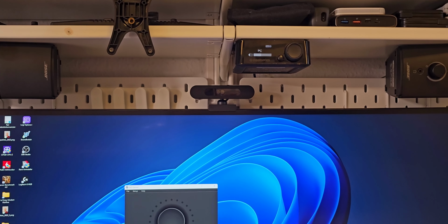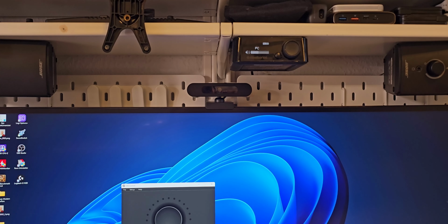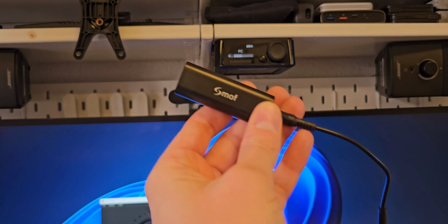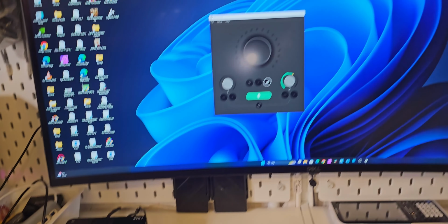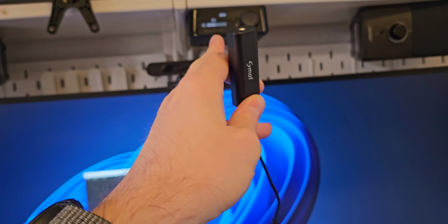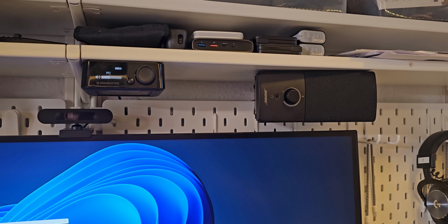And just take a listen for the noise floor here before connecting the ground loop isolator. Just get this very annoying hum constantly. Let's try and install this one on this device here. I'm going to connect it to the SteelSeries box. So my Evo 4 will have the direct connection, not going through this one here, but the SteelSeries wireless box will go through this device and go into the PC input on my Bose speakers. And hopefully that will eliminate this annoying hum.